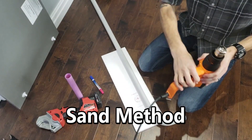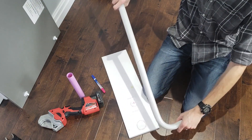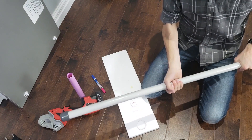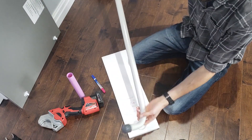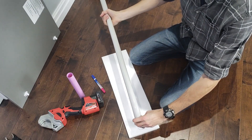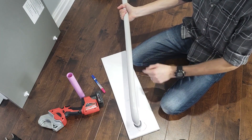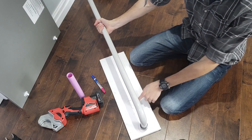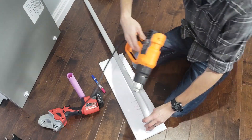For method number two, I'm actually going to show you on a piece of PVC I'm going to be bending for my system behind me, because I already have it capped off. What I've got here is a PVC end cap on the pipe — I've already got a small section bent — and there's a PVC end cap on the other end. All I did was fill this tube full of play sand. So this tube right now weighs a heck of a lot more than it normally does, but it is completely full of sand. I have a short measurement of where the PVC starts and roughly where I need it to be bent to, so I'm going to try to heat up a small section and bend it so that it is facing up where the circle is. Wish me luck — this is honestly a very tight bend and I'm not entirely sure this is going to work well, but we're going to get this shot.